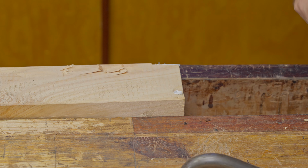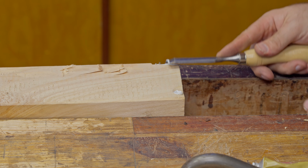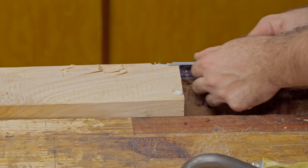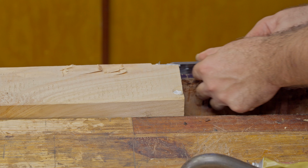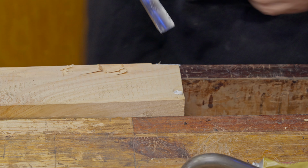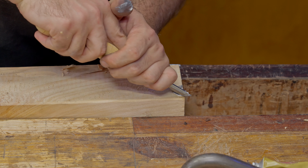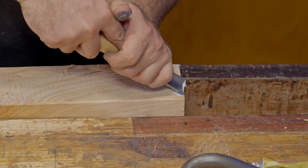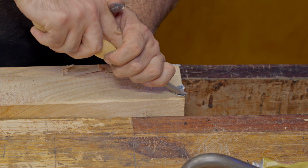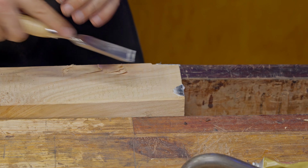If you need to add more honing compound, just keep adding it. So what you've essentially created is a little honing block. So I can feel that that burr's gone. The other way, in that arc, and you can see you just move it backwards and side to side, and you can see we're taking metal off. It's gone black.